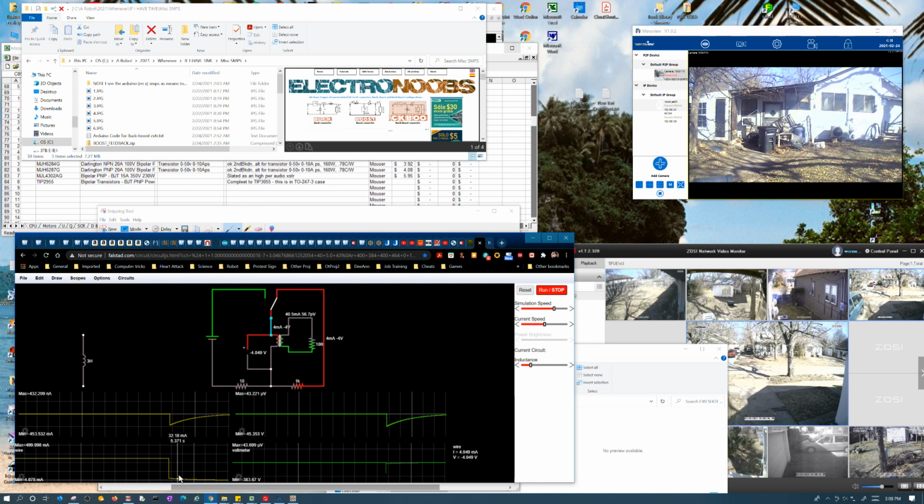But you can see, like I said, only 5 milliamps is actually going through our... because this very quickly drops down to 50 milliamps, and we got 50 milliamps going through it. So again, it's taking however much of the current. Well, that's 10% of the current. So again, our little 1K resistor here is eating up 10% of the current. So it's got 50 milliamps going through it, not 5 like I said before. Because it was 5 in our last circuit, but here it's 50. So I guess this is what was misleading me, seeing that 4 milliamps there. But yeah, this has got 50 milliamps max going through the resistor.